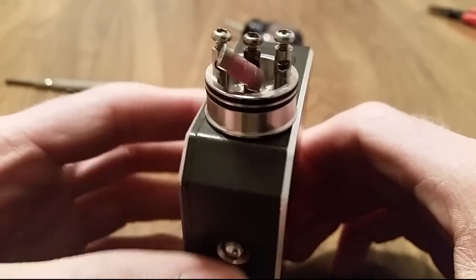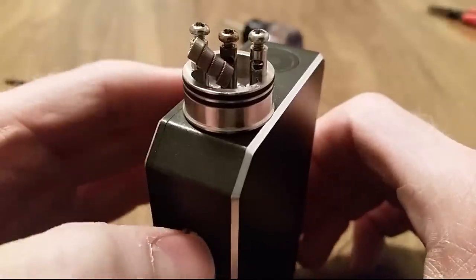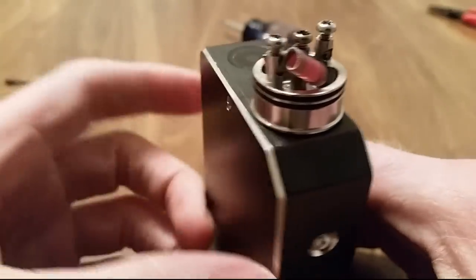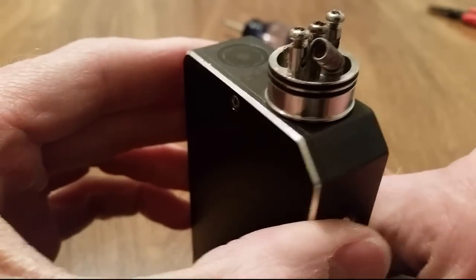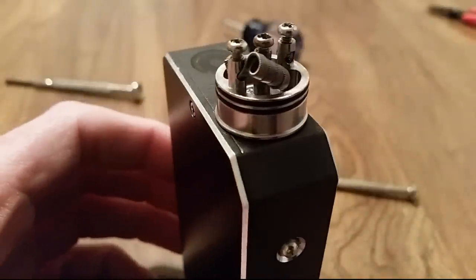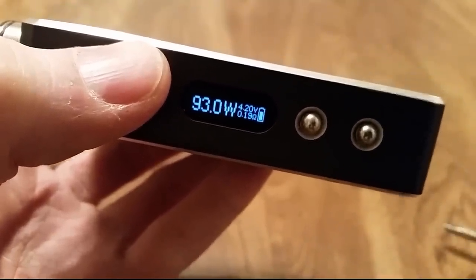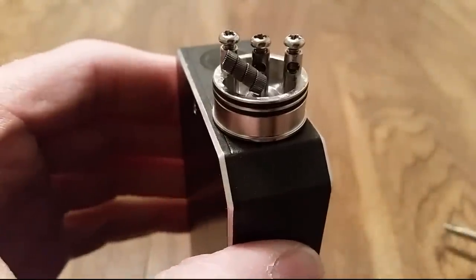I'm going to actually try another one. I'm going to do it on a 3/32 drill bit, just to see what it ohms out at. And then we'll know the ohms of this coil on two different sizes. This is the 1/8, came out to 0.25, 0.26 area. And then I'm gonna try it on a 3/32 inch, and we'll see where that goes. Okay, on the 3/32 drill bit size, we're looking at 0.19 ohms for a single coil, which at 4.2 volts lights up quite a bit quicker.